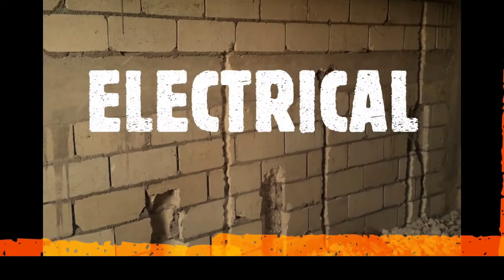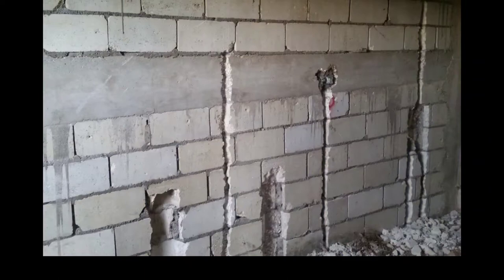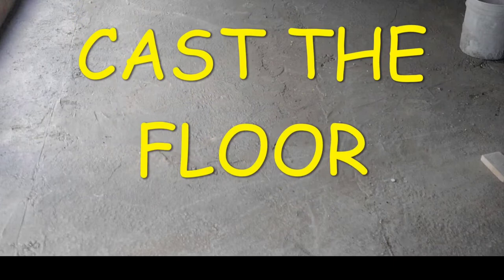So the first part is, as you guys know, that they already had pre-run your electrical piping, which they should have done, your install of your piping in your block wall already. So basically, they're now going to be putting in the actual PVC piping and putting in the boxes for your plugs and for your switches. So after they put in all the piping and all the casings, the next step is to draw the wires through. So once they draw all your wires through, they bring it back to your breaker box, your breaker system.